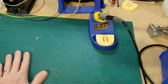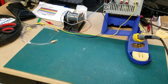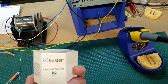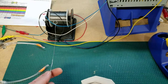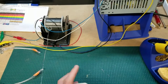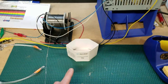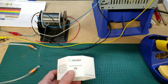Anti-static mats are obviously important — connected and grounded, great for making sure you're not causing static issues when working on board work. I'm a Kester fan; I use only Kester leaded solder, 0.33mm, with internal flux. John Wart, one of the pinball restoration legends, turned me on to Kester solder and I have not looked back. It just flows better, it works better — I won't use anything else.